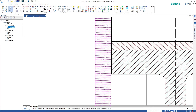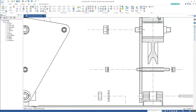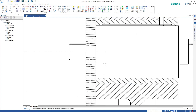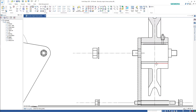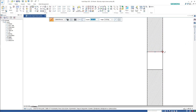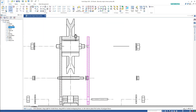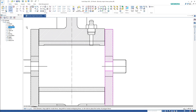The difference is that the sheave is only 99.5 mm while the sheave pin is 100 mm round, so there is that half-mil difference on both sides. I'll have to come back and put that in. Done. Now I'm going to copy and paste the other cheek plate, then copy it across from center mark to center mark and check that they are parallel at the top.